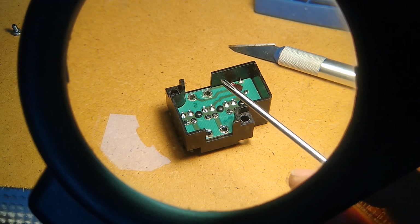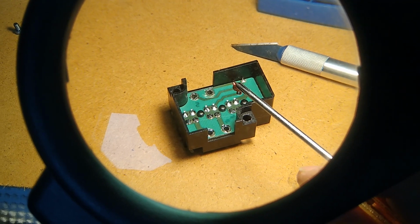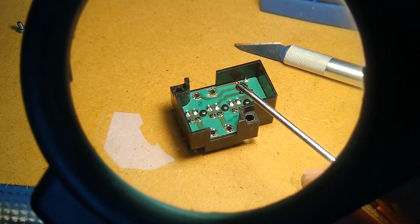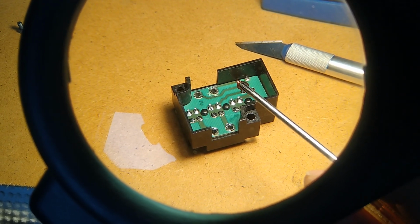Okay, here under better magnification, you can see these two pins. The pin sticks through the solder joint and is somewhat fractured around the pin at each point as it goes through this little puddle of solder. And that's what we're going to try to heat up and place some new solder on it.